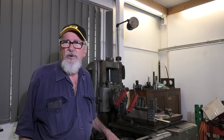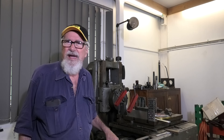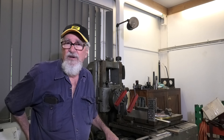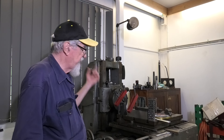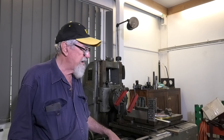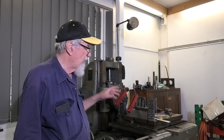Well, I hope you enjoyed your little look around my Kearns type S borer. It's an interesting machine and even with the very vague workshop manual I learned how to use it — and that did take a while. Not being a machinist by trade, it was something new to me. I had a few accidents — I had a piece of durabar 180mm diameter up on here, trying to face a straight bit on the edge, and on the first three hits it went over my left shoulder. Four clamps holding it and it just rotated against the facing cutter and disappeared. Very close to an accident on one of my first jobs here. I've enjoyed showing you around — if you've got any questions put them in the comments and I'll do my best to answer them. If you like today's video, like and subscribe and see you next weekend.